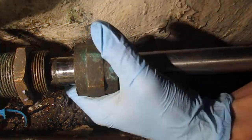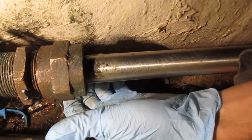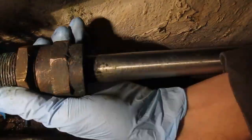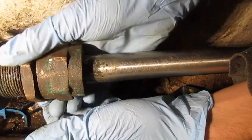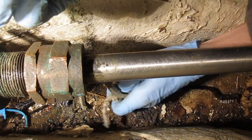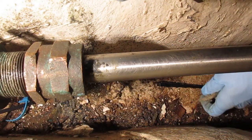Once they're all in, go ahead and bring it back down and tighten it back up. Until the boat goes back in the water, I typically only leave this hand tight and just back the locking nut up so it doesn't come loose. I'll do the final adjustment when the boat's actually in the water. And that's it — now we just clean up our workspace and get all the old and new packing material out of the bilge. I really hope this video helped you guys out. Stay tuned for the next one.